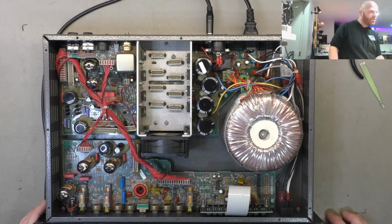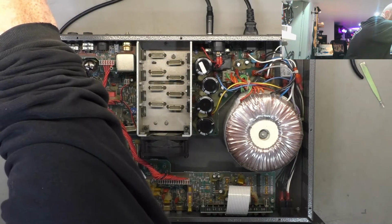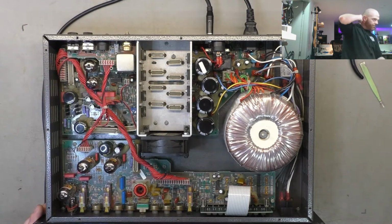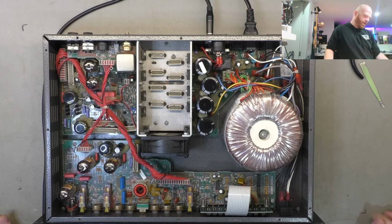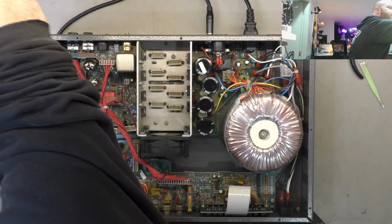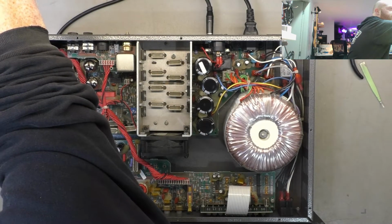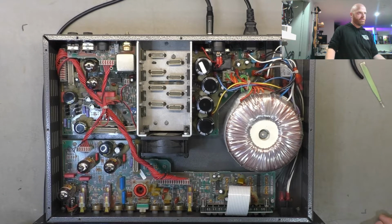We're settling at 50 watts. That's not quiescent, let's just turn that down. 50.8 watts. So that's 0.35 amps, so that's probably about half of what that bias setting measurement was. Being that we're on 240 volt mains, I'd say proportionally that's about right, because we would be at half the amperage of what a 120 volt country would be expecting, but same amount of wattage, so about 50 watts.